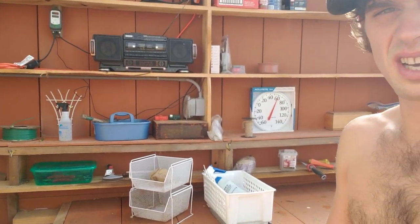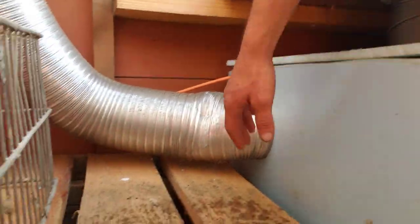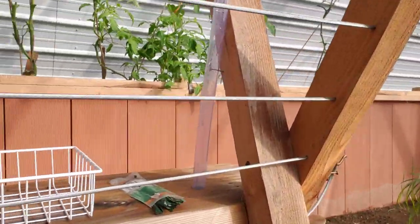The geothermal system consists of 11 6-inch corrugated pipes going 9-foot underground. They go 40-foot outside the greenhouse and loop back up to the second riser. We have the first riser right here with two pipes hooked up. This black 6-inch corrugated is a shallow-ran pipe — you can see it coming up here, just ran along this north bed, all the way down, loops around right up by the stone, comes back, and ends up right here.